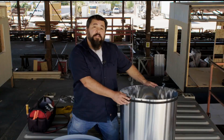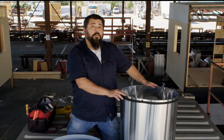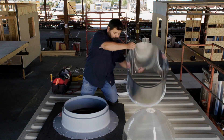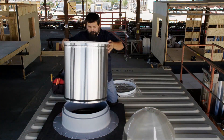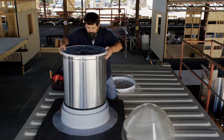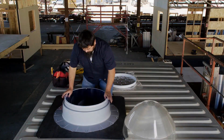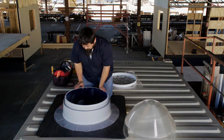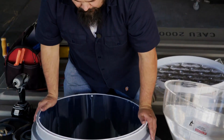We'll take our diffuser seal and just above the scored line, apply it to the tubing. With the diffuser seal in place, we can now install the tubing. Because we've made the opening snug, we're going to install the diffuser from the bottom. Now that the tube is snug to the flashing, we can install the dome.